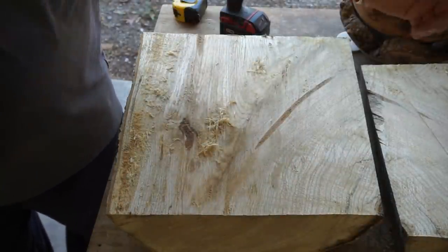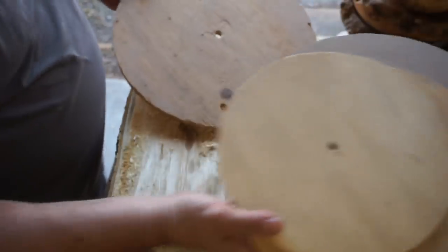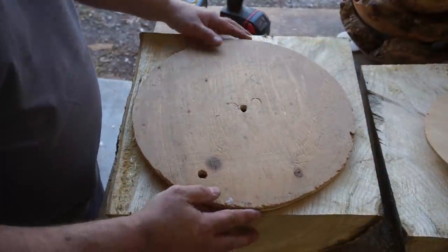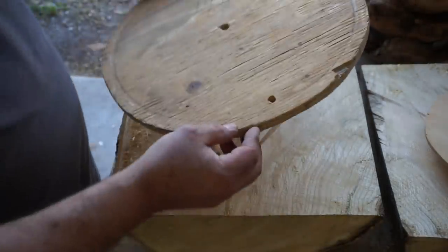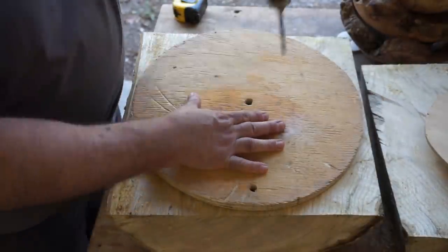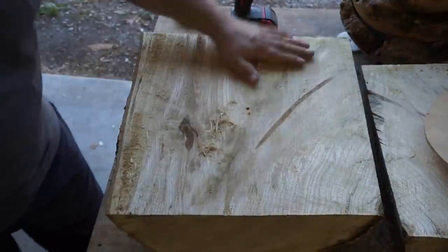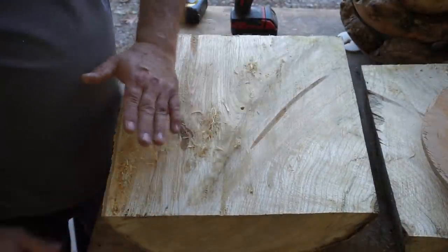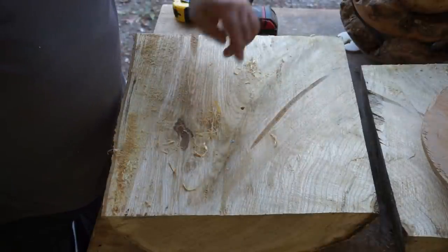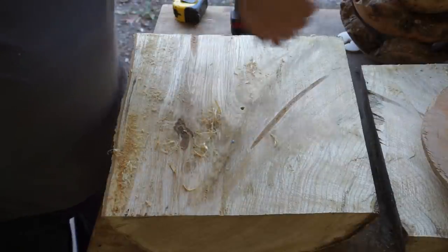These are two sides of a hickory crotch — pretty tough stuff to cut up. I've got all these different templates. We're going to go with the 14-inch, and actually you might even be able to use the 15. To be perfectly honest, it really doesn't matter — this is 14 and a half, and that's pretty good. Take your drill and bore the center hole. One thing to note: this needs to be a really flat surface. If it's cupped, dished, concave, or convex, you might have a problem with the pin getting in the hole and staying there when you're rounding. Let's round it.